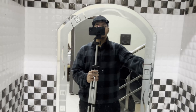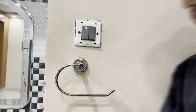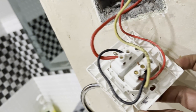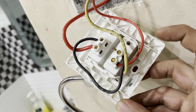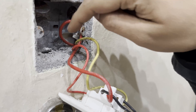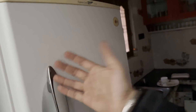Now to make this light and this light automatic, I need to open the switchboard. Here I can see only 3 wires, which means there is no neutral, only phase. So I need to find the junction box. I can see there is a pipe here going straight into this switchboard. I need to move this fridge aside to access that switchboard and open it.